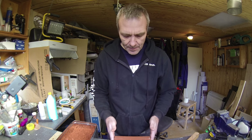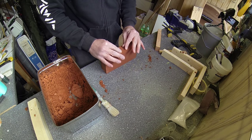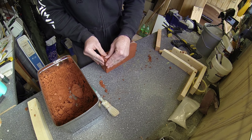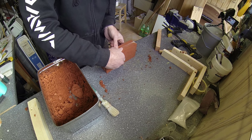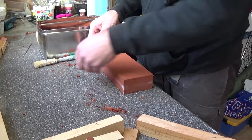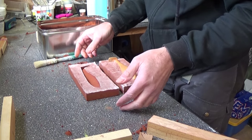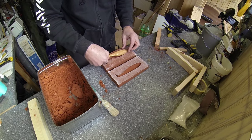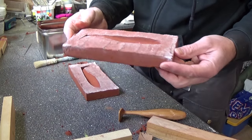At this point where you've removed the mold from the frame, you have to be very careful with it, because it can easily take damage or break. So I'll just very gently try to open it along the line of the talc here. Like that. Okay, I'll just lay it down here. And as you can see, it really has a nice imprint, and I can carefully remove the master like that. And well, it's a real nice complete imprint of the master here.